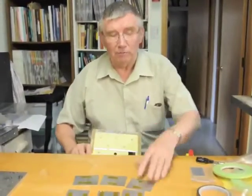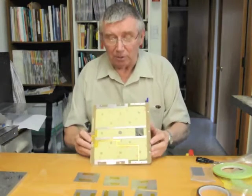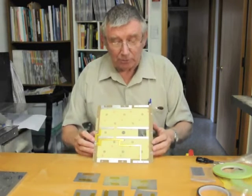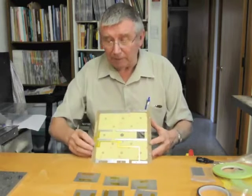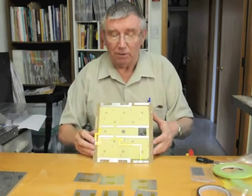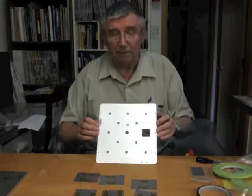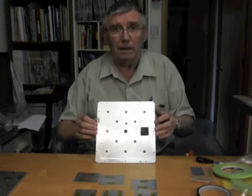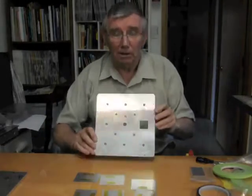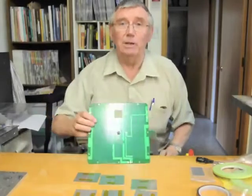For demonstration purposes, we've now got these pseudo cells, which are very cheap and cheerful, and I'll show you now one of the panels, which in fact will fly on the satellite. As you can see, it's made on a printed circuit board, FR4, and there are various areas on it that are masked off with Kapton tape that we can't afford to short across. On the underside, you can see there is a 7 thou thick aluminium foil, which will carry the heat away from the centre of the board into the screws around the edge, which of course is part of the space frame. I'll now take this away and put it safely out of the way as I did with the cells, and we will use this to demonstrate further.